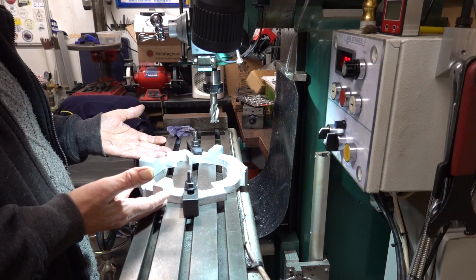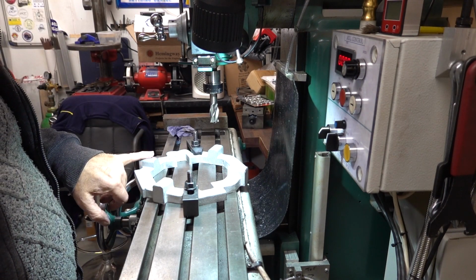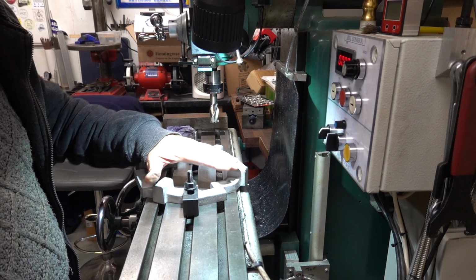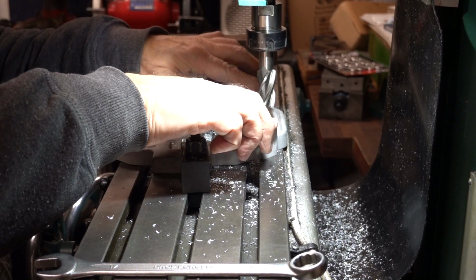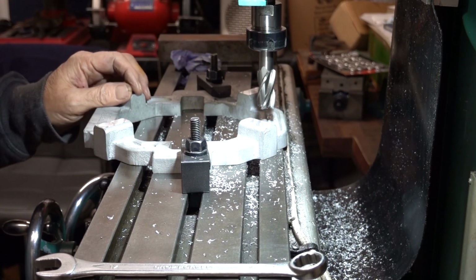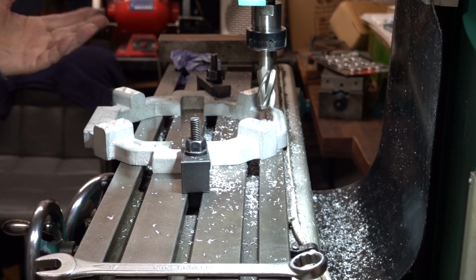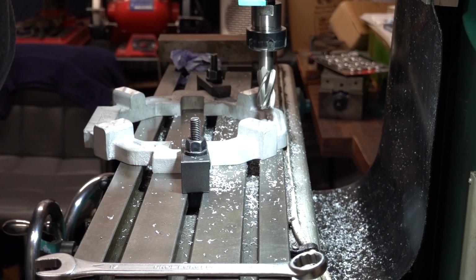The back is quite flat to start with, so I've clamped it, and that is flat on. So I'm going to skim them so they're all identical. So I'll find out which is the deepest, and I'll just take a few thou off, but basically 3 of them are undersized already. So I've taken an equal skim off each of these. Well, that one's going over again. I had to move the part across because this distance I can't get to both ends, so I had to actually move that across, then spin this round and do the other one. I don't like moving the piece, but what can you do? Okay, I think I just need to run over that again really carefully, but yeah, we're done. So it's time to spin over and hope I can get it flat.